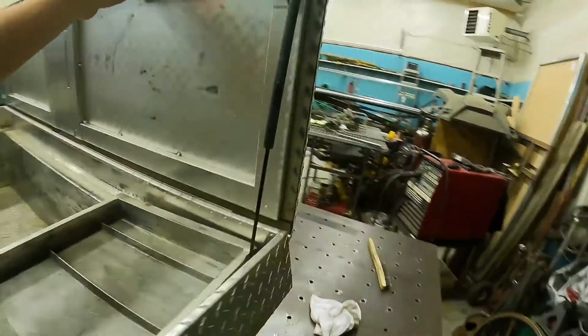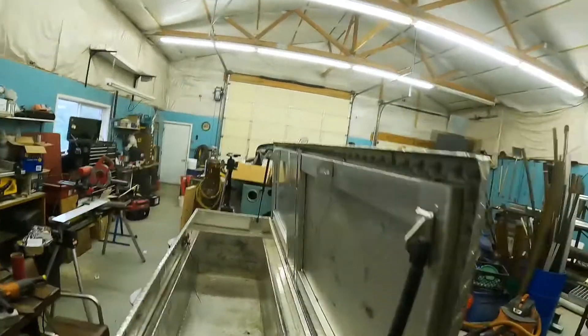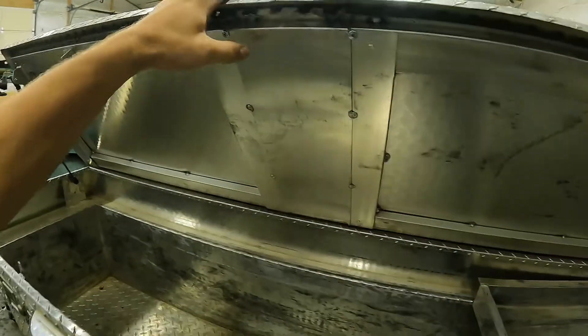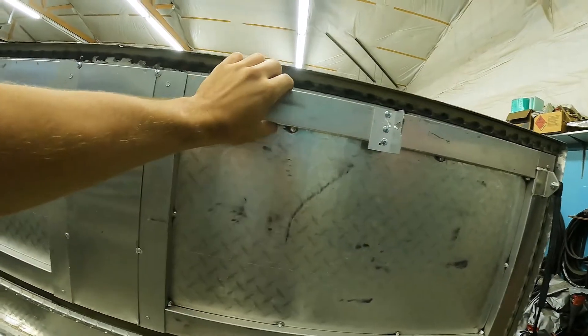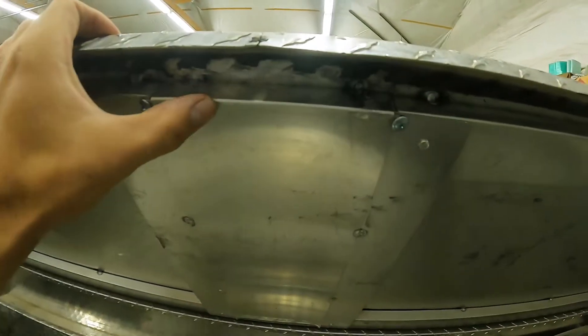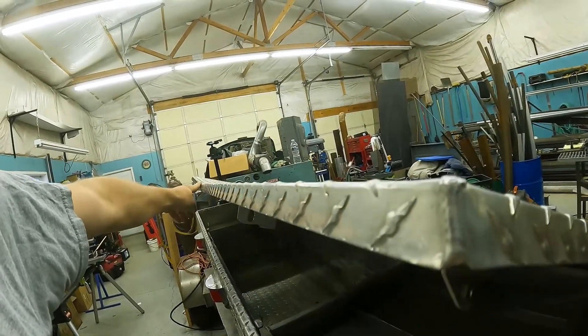You'll see there's cracks all over. The GoPro's not best for that, but you can see that's cracked all the way across right there — same on this side. Up here, if we look across the whole lid, right there, it's curved pretty good. And that's because when it was designed, you grab the middle to close it. Well, these bars that are supposed to support it don't go all the way through. They stopped them right there and right there, and this offers a lot of flexibility. So when you go to close this from the middle, you end up with a crack like that. Holding it in the middle to close it down, you can see the curvature quite a bit better.